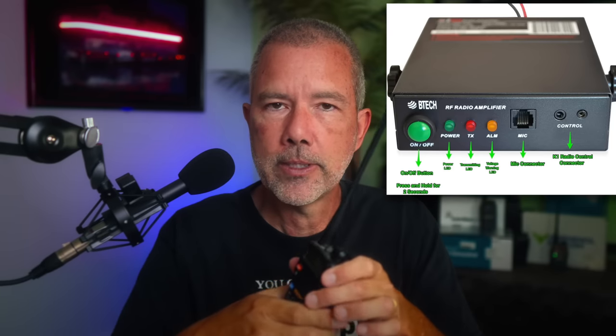It's an inline linear type amplifier, and it comes with all the cables and everything you need to connect it up. It's made to use in a car as a mobile, to basically turn your UV5R into a mobile radio, so it comes with mounting brackets and a cigarette lighter adapter plug for your 12 volt source. But you can easily use it in your home to make your UV5R into a base station — all you would need is a 12 volt power supply and a better antenna; you cannot use it with the existing antenna. You can use any mobile antenna tuned for the frequencies you're going to transmit on — I'll put an affiliate link below to one of the Nagoya antennas that BTEC recommends. The only requirement is that your radio has to transmit between four and six watts. It has a built-in speaker, and you can connect a regular microphone with a cable so that you don't have to keep picking up the whole radio to transmit.